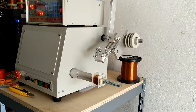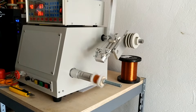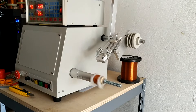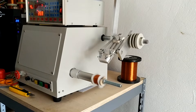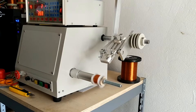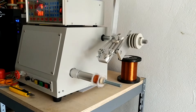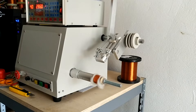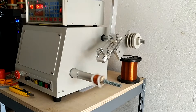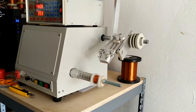Here I'm winding the secondary winding, using the same wire gauge. It doesn't really matter — you could use anything close to 0.18 to 0.25mm. Whatever you have on hand, anything thicker than 0.15 millimeters you could use for this transformer.